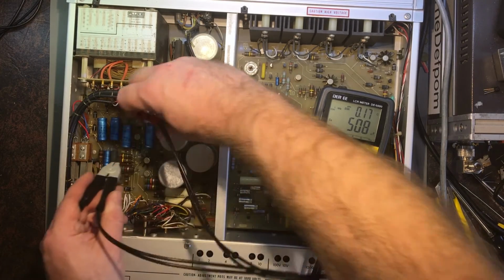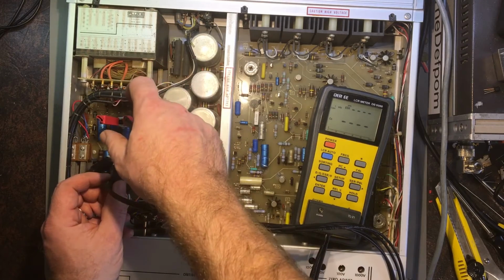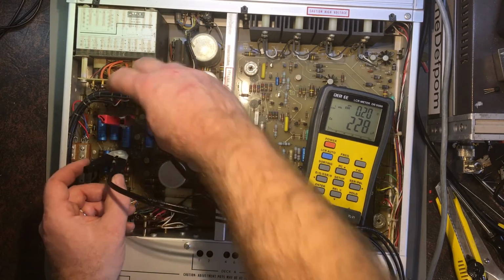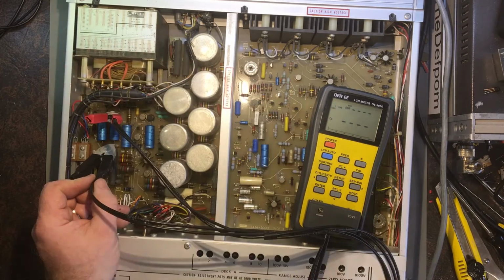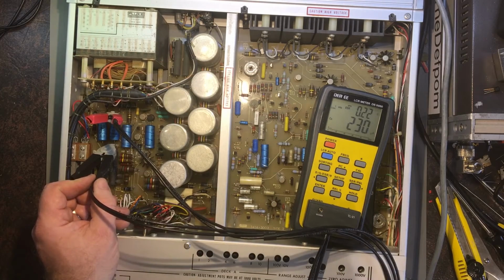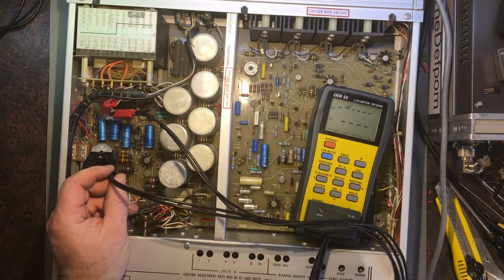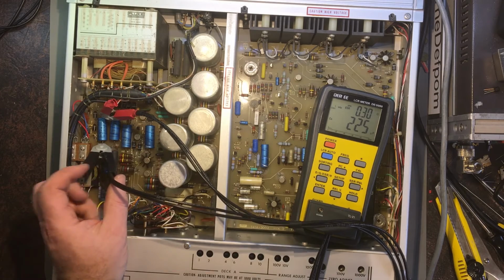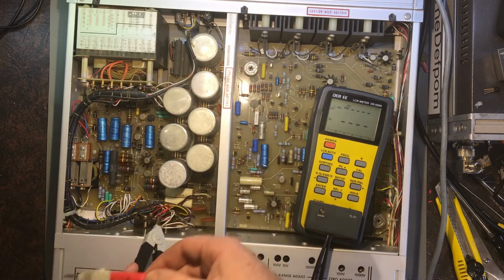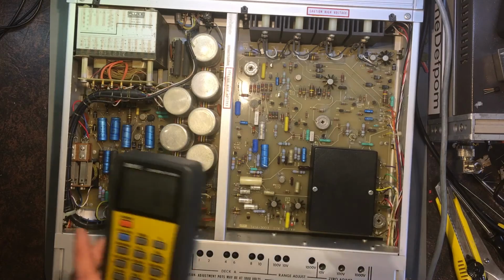Yeah, looks right. I've noticed the capacitor values are all on the high end, so they've all drifted over time and got higher capacity. They're all the same, so the ratings are often like 50% more and things like that, so it's something weird on that, but yeah, these all look okay. That's all those ones. So the capacitors seem okay.